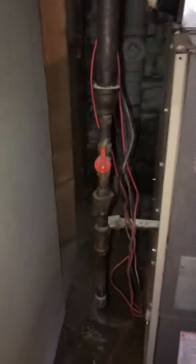There is an isolating valve on the gas. You can see the communication for the thermostat there. Electrics are in a conduit. It is a four-inch flue which we'll need to update — there's some signs of a little bit of corrosion on it, especially early on.